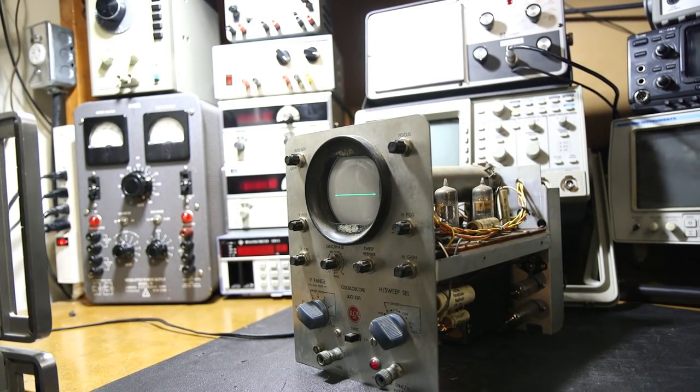Makes me wonder. The really ugly looking scope is working. Maybe it's the nice one that doesn't work. I better shut this thing off while everything's working. So that's a good indication that the CRT is good. It was at 85 volts there. It's not even up to the standard 120. All the tubes are lighting up, lots of brightness, it focuses. So really, this oscilloscope could very easily be resurrected and turned into a working device or turned into a nice piece of test gear.